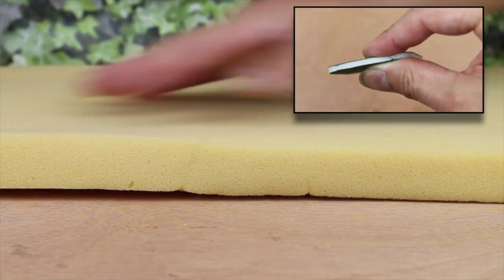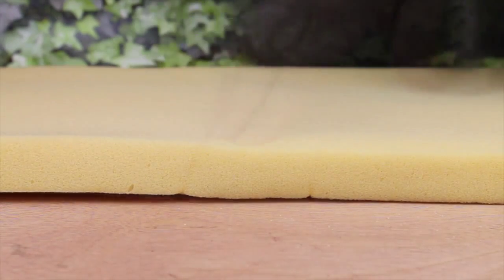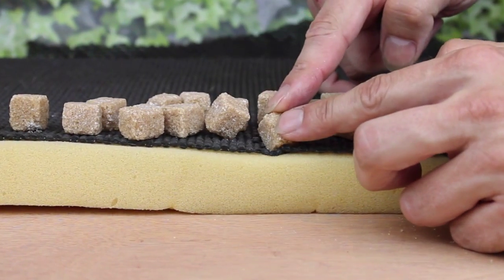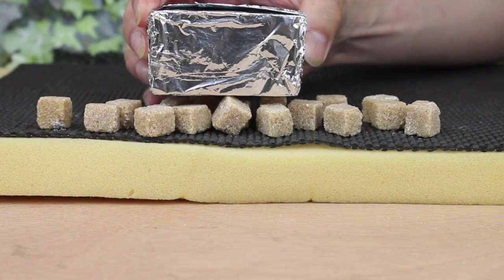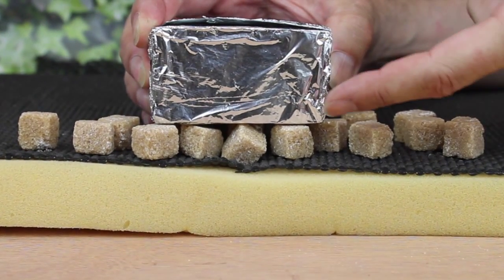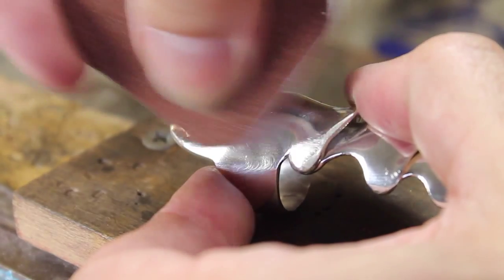In comparison, these micro mesh pads are foam backed, so that gives a little bit of give in the surface. But the real genius to the micro mesh is this layer of latex adhesive, and this allows the crystals to move and rotate slightly. So when the metal comes into contact with the pad the crystals can rotate and be pushed into the foam a little bit. This means you get a perfectly flat, even cutting surface, and this gives several advantages.